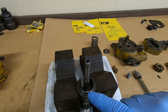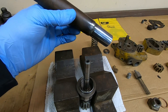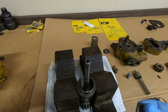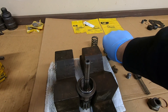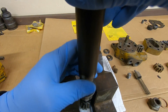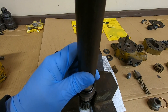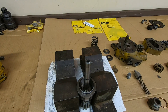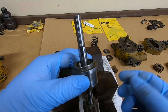There's a tool they say you can make for this, but what I've found is I just use this - it's a 7/8 socket that I slightly modified to disassemble oil filter cans. You'll be seeing more of this little tool when I get into the filter for 11-13. What I like about this is it's 7/8 and it fits those little support washers just perfect. So I don't need to make another tool - I've already got one. We'll go in on top of that support washer and just tap it in a little bit, just enough to seat that packing out into the retainer.